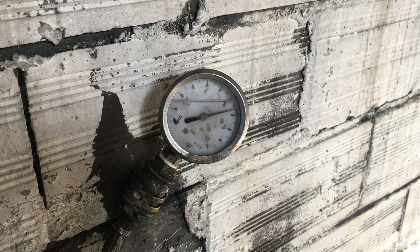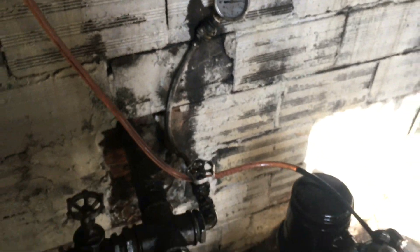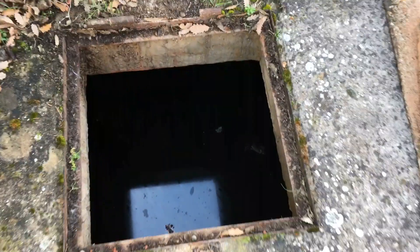So the pump is now running, everything is looking fine, we've got pressure. Let's go back to the house once again. The pump is rated at 7 cubic meters per hour, which is 2 liters per second, which seems about right for the flow we're getting. This is the other water deposit, which is filling up at the same rate, obviously.